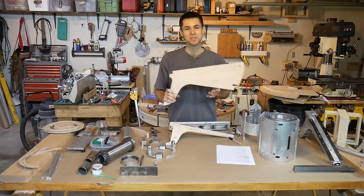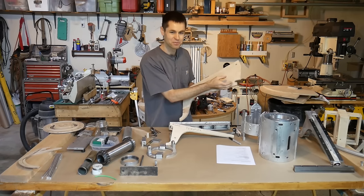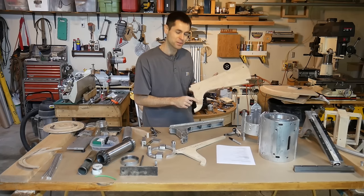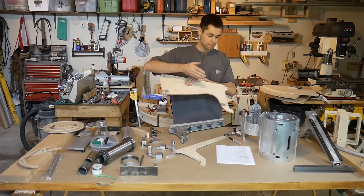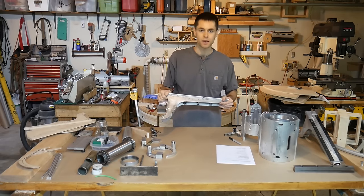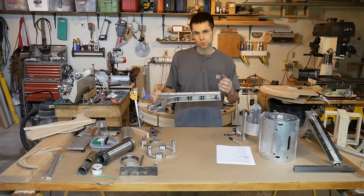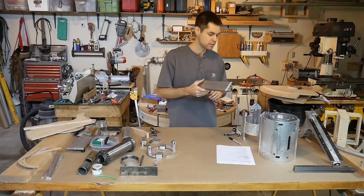So what I built was a template where you would register the top factory edge against here and it would give you more support — except that I had welded the pieces together down low, so I had to remove material there. You have to do it on both sides because you have pieces going on either side. But the arm shape has eventually become simplified because this was way, way too complicated. It requires too much welding, and it causes problems with distortion because the weld metal shrinks so that your top is not flat. The arms became greatly simplified.